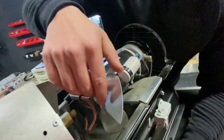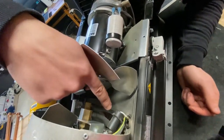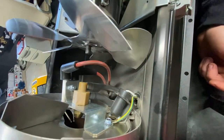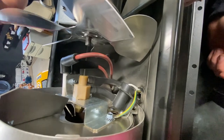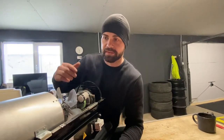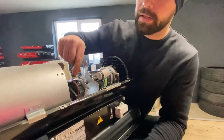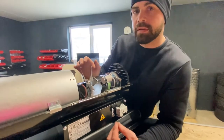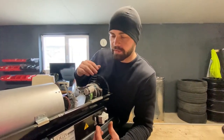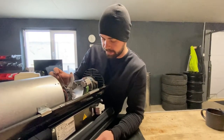Something else that's super important: this is an infrared flame detector. In case you're not here and the unit is running on its own — which I don't recommend, since it produces a big flame — you have this infrared sensor. If there isn't a flame detected, the machine will turn off so it won't just pump fuel everywhere. If the flame is missing, the unit goes off by itself.